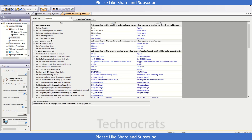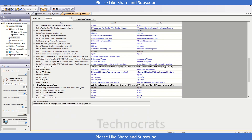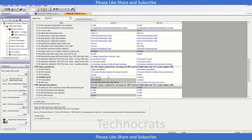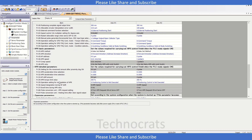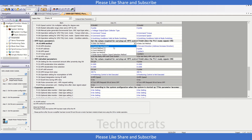Let's go to the parameter section again. In the parameter section for homing, we have the HPR basic parameter setting. You need to select the HPR method first before doing the homing. With the proximity dog method, we can also use the data set method. In the data set method, wherever the servo currently is, if you execute HPR, it will assume that position as home — position zero. Let's use the data set method here, set to zero, same for axis number 2. We have all the settings for HPR, including dog methods and count methods.